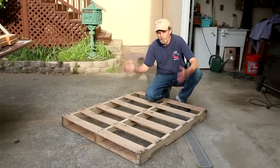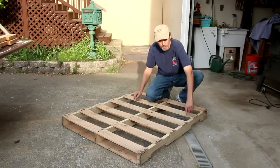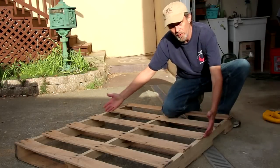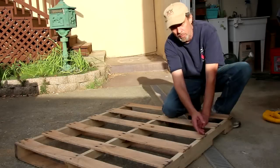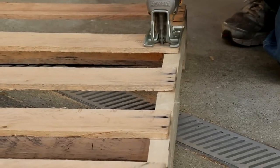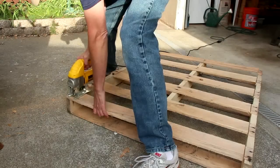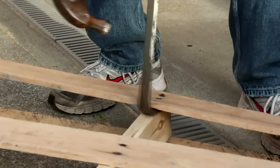You need to ask yourself what parts of the pallet do you want to salvage. Is it important to you to save these split ends with the rusty holes? I find that trying to pull these boards off completely is really time-consuming and very difficult, and oftentimes the boards just end up splitting and become unusable. So all I'm going to do is cut off these end pieces first using my jigsaw, and I'll just pry off the center parts with the crowbar.